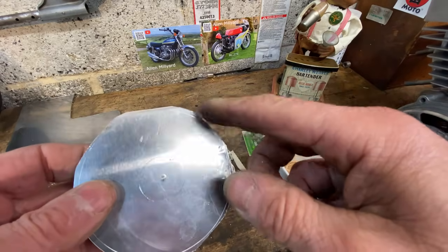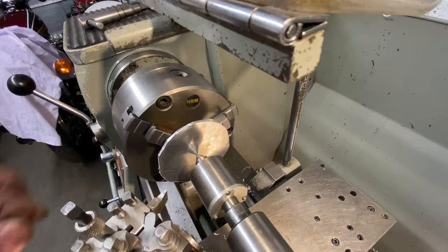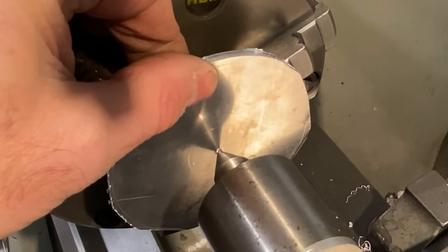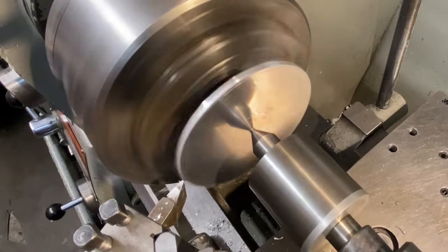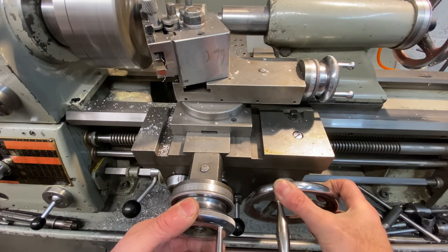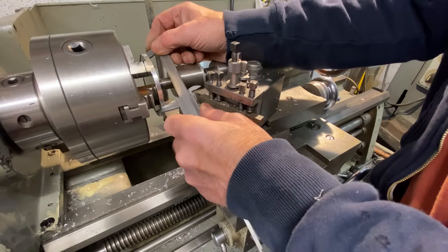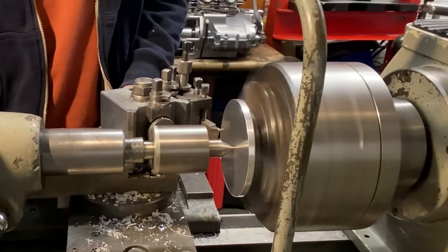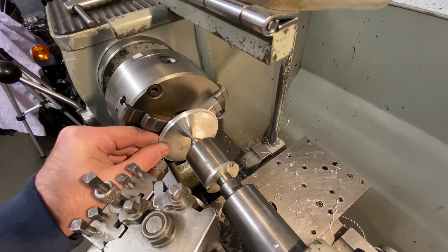To machine the diameter of the plate to exactly 90 millimetres, I rest it on the front face of my chuck and use my rotating centre to pressurise it and hold it in place, where I carefully turn the diameter taking little cuts at a time. After several cuts the aluminium plate is nice and round. I check it with my Vernier caliper — it's 92 millimetres — so I've got a couple of millimetres to remove. I take a few more cuts and then when I check it, it's just perfect.